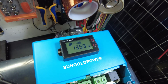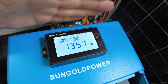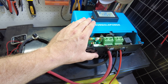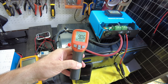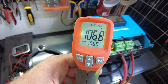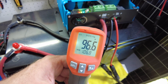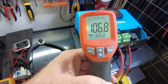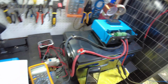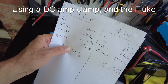After letting this run for a bit, we are still cranking at 1,357 watts — all is well. The unit has gotten slightly warm. The top of the battery is at 90 degrees Fahrenheit, the controller is at 106. The fins on the back are actually cooler, a little warmer up at the front — I guess that's where the inductors are.